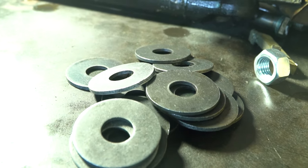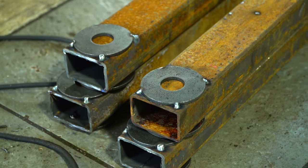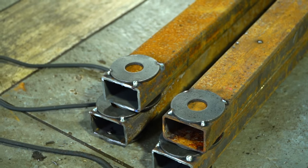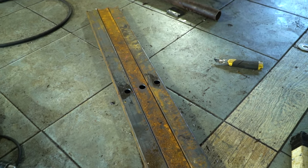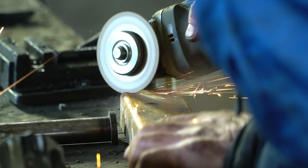All the pinholes will be reinforced with washers or metal slabs. The holes for 25 millimeter pins are drilled in the center of the crossbars. The other end of the crossbars was sawn off for a better fitting to the coupling pipe.